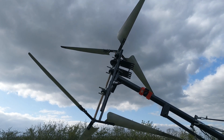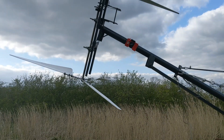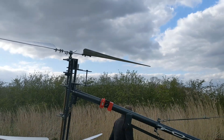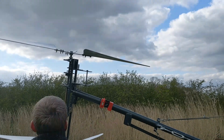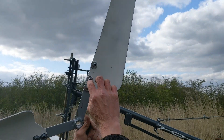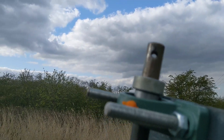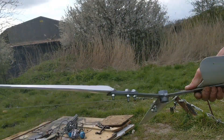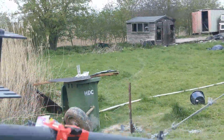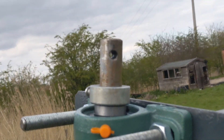We should be able to get to the clanky one. Oh, it's lovely and light this thing. The simplest thing to do here may be to flip the blades around. You can see the hole there — it's very close to the end — so I just need to undo the bolts and flip the direction of the blades. I've realized the hole is only 7mm, so I'm going to put an 8mm hole in, then use an 8mm bolt and it'll be perfect.